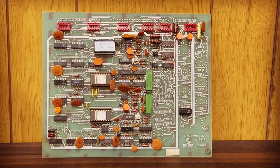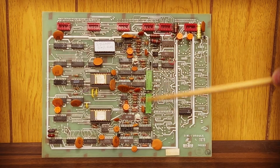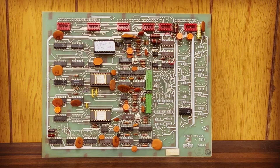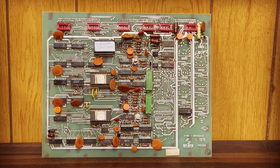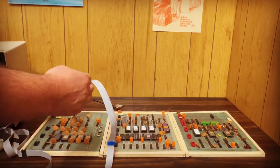This empty area on the right would be filled if you were using the board as a modem. The SIM has its own ROM chip containing a small amount of firmware to read and write the cassette data. Just like our CPU and CRT boards, the SIM board is part of Sphere's modular system philosophy. It connects in using the same four ribbon cable setup. So let's get the SIM connected into our Sphere.